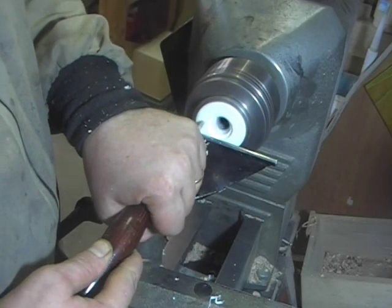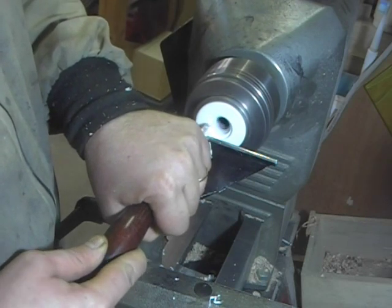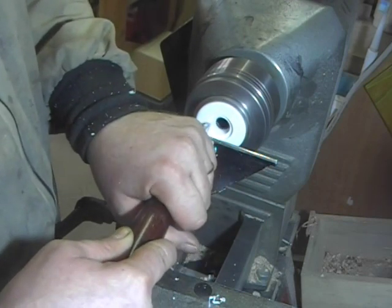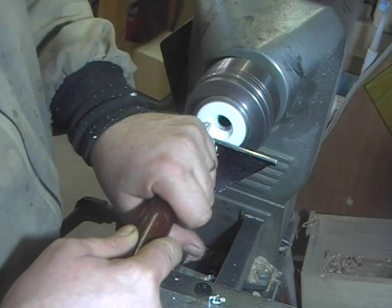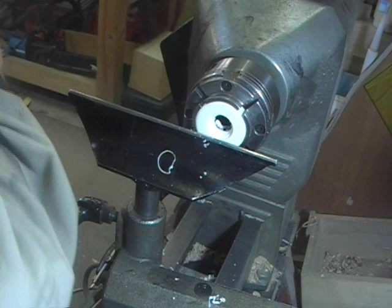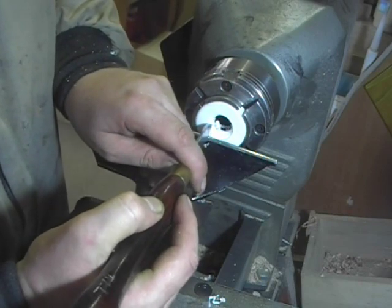And then, important part, this area right here next to the hole, see out here it's kind of bouncing around? I don't really care about it there. Right here, it will actually touch the bottom of the bowl. It's about 4 or 5 millimeters deep, I guess. You want to make sure there's no extra junk in the middle here that's hanging out. The important part is the shoulder here that's touching the shoulder right here that will be gripping. This part in here is not really so important.